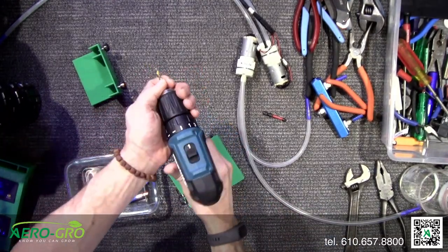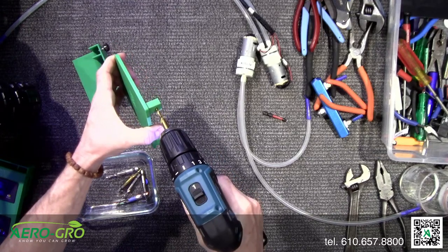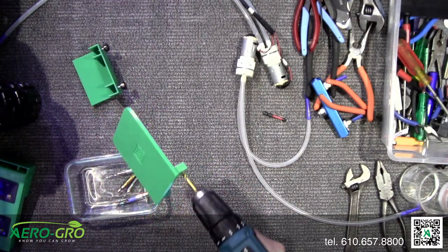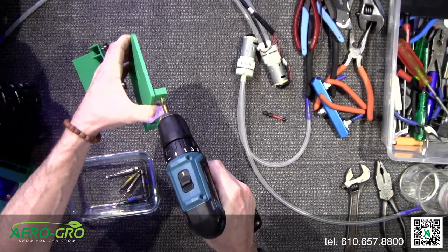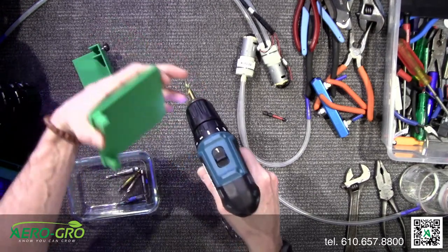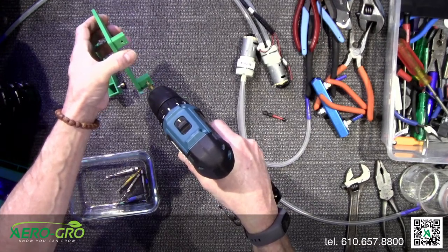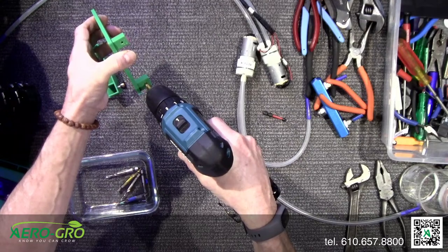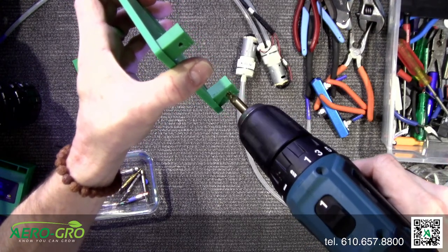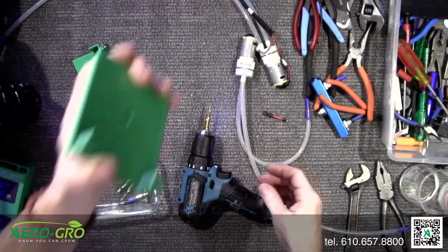All right, now I'm gonna get my focus back in here. Okay, so pop that in here. Slow speed, always slow speed when you're cutting threads. There are your holes, right? Very slow. Straight in, as straight as you can do it. Unplug that now, it's too noisy, it's driving me crazy. All right, go in. When you get to the hilt, very slowly back out. Reverse the drill and back out. One more time. Go in slowly. Contact the threads, then go slowly again all the way through. And when you get almost to the hilt, not all the way to the hilt, you strip the threads out. Almost to the hilt, like that, back out. Reverse your threads and back out. That's it. Then blow it out, do it again.